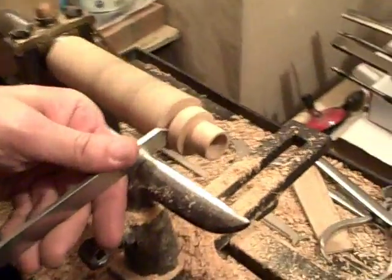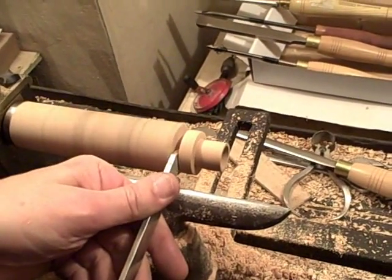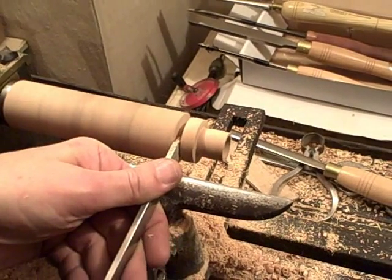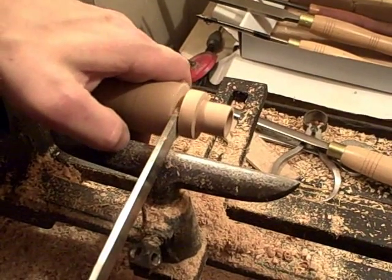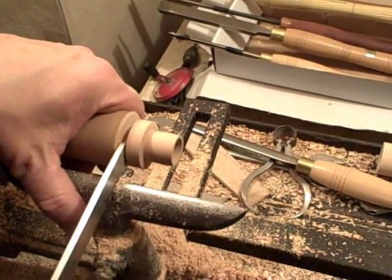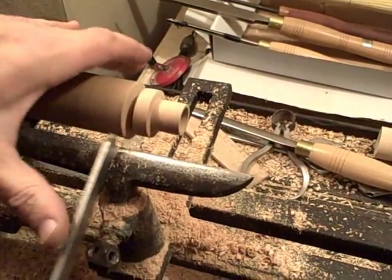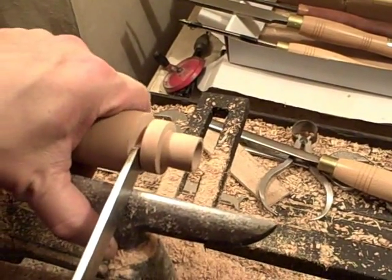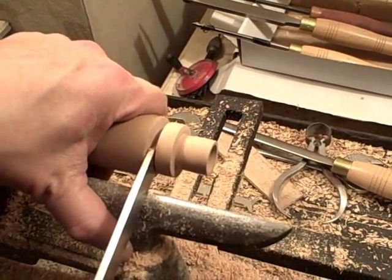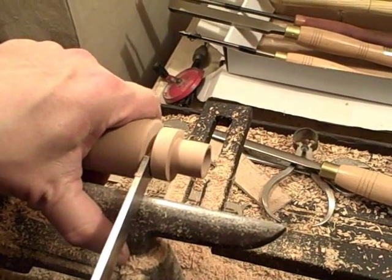I will show you the hollowing out of the bottle, because that's an important part of the process and it's a way I think would have been done at the time. Let's just take this down a little bit of the way — most of this was done with a saw anyway. I've noticed that there's a little bit of wobble on there, so I'm going to do my own steady — put my hand at the back there, just to prevent that bit of wobble. I think having people watch me has made me a bit more careful than I normally would be. I would have brought that tailstock up and put a bung in there, just to make that a little bit easier.